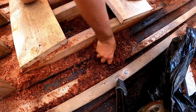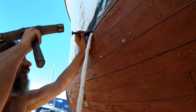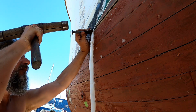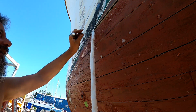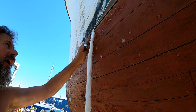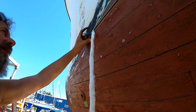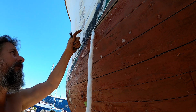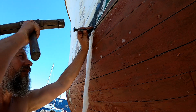This is a lot of sapele. I'm having to do a little bit of caulking because I have to get these seams finished that go through the water line so that I can get them caulked and paid and dried and faired, and so I can paint the boot stripe on sooner than later because of the sequence of events it takes before I can actually paint topside paint. So just got to rush this particular part of it.